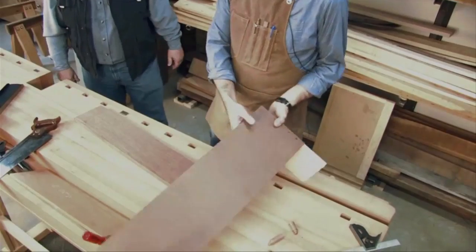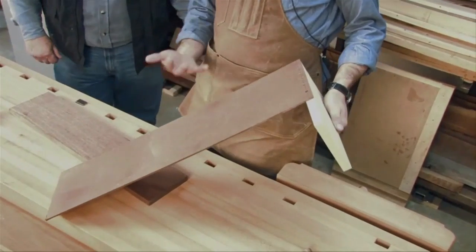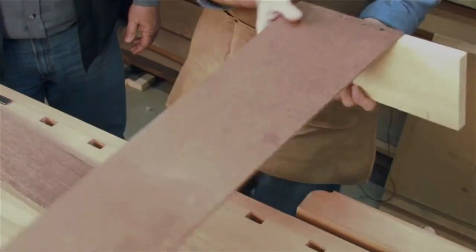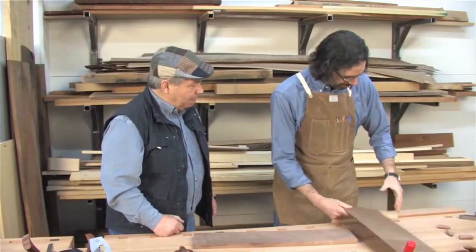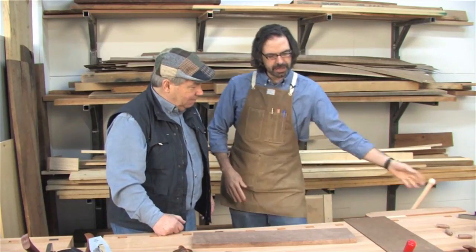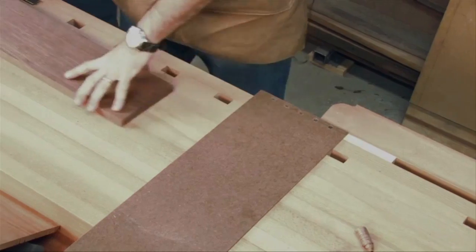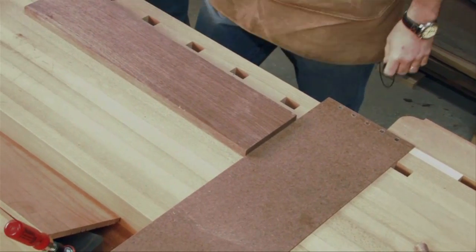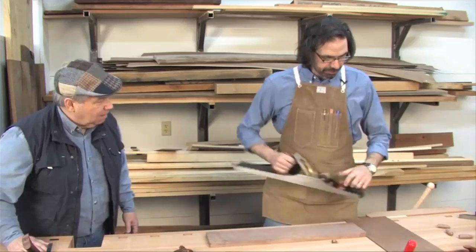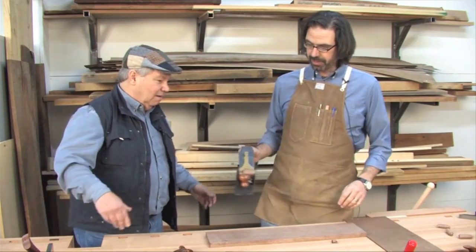What we've got here is a planing stop. Unlike a really fancy blacksmith planing stop, this one is just a quarter-inch masonite, drywall screws, and a 1x4 screwed together in an L shape. What this planing jig allows you to do is work without a tail vise. We can plane entire wide panels here by just buttoning it up against the masonite, and we can plane really, really thin stock — which is one of the downsides of planing against dogs.